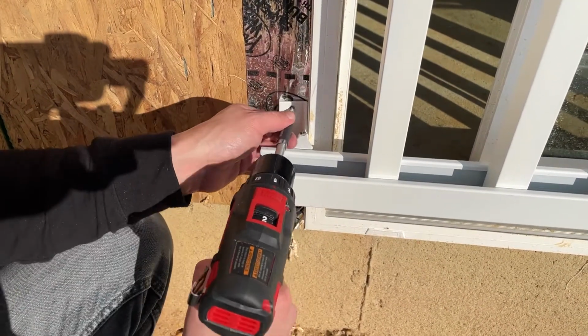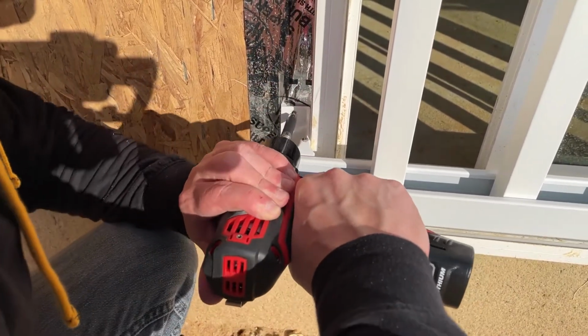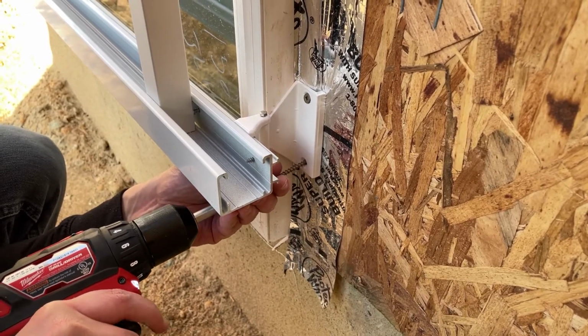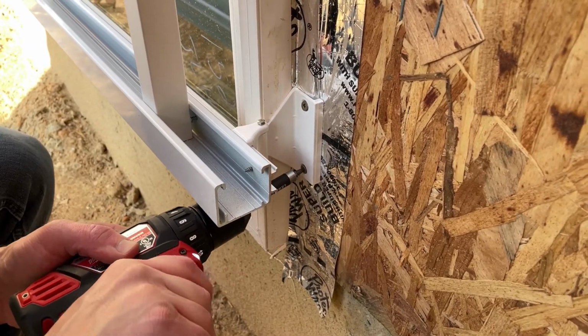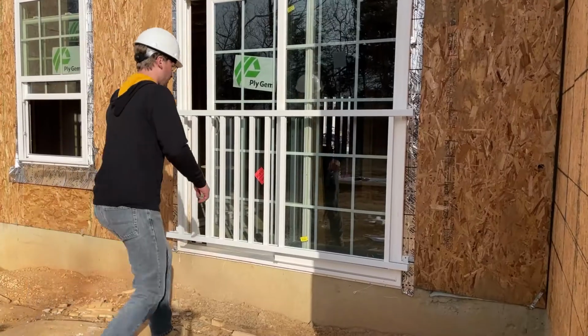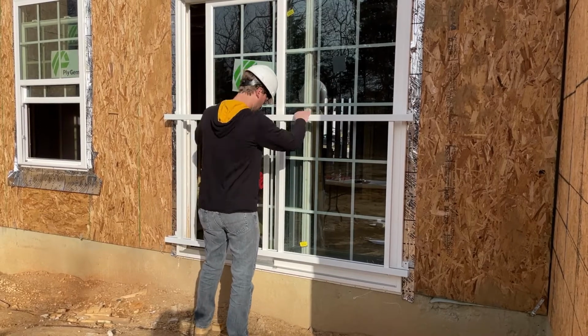Use the remaining wall screws to secure both bottom rail bracket assemblies to the wall. Ensure the wall brackets are snug to the outside of the door frame. Check that the rail is securely in place.